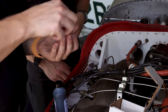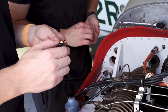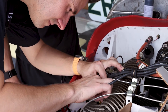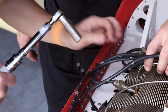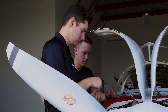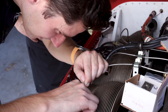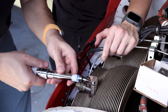We're going to verify that cylinder three is 151 and it should be M — 151M. Then we're going to start getting those installed. For cylinder five, that should be GF — front — and it should be number 143. We have to put a little bit of anti-seize on here. We're still torquing at 55 inch-pounds.